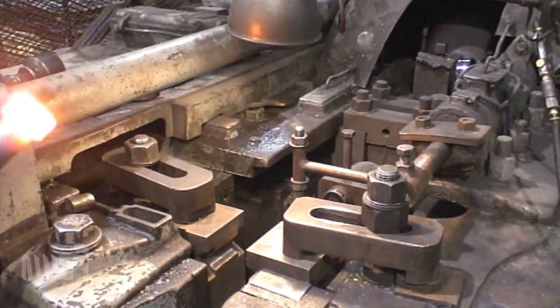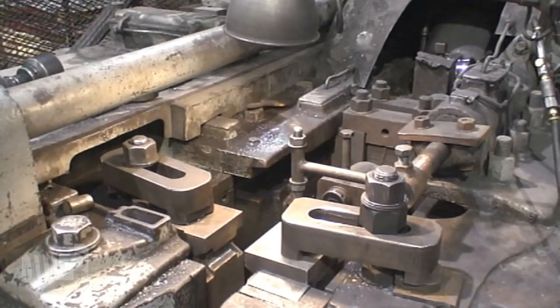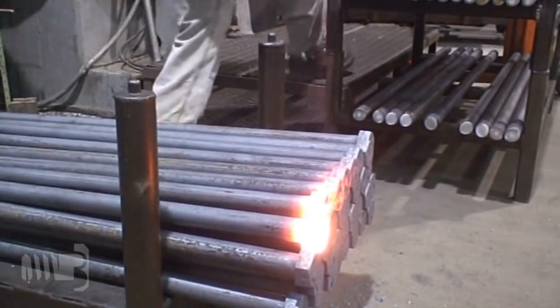A second position in the gripper block is used to stamp the head with the manufacturer's logo and grade symbol as required. The hex head of this anchor bolt will be embedded in concrete and is intended to provide pull-out resistance.